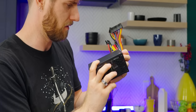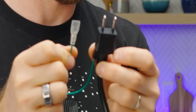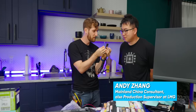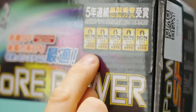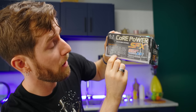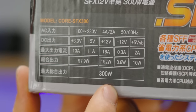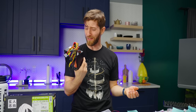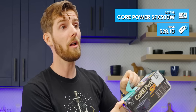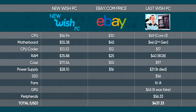These are not especially confidence-inspiring cables. Is this how grounding is supposed to work? Where in the world is that the standard? Our mainland China consultant says — what? Of the 300 watt total capacity, only 192 watts are on the 12 volt rail. This thing is freaking designed for like Pentium 4-era systems. Wait, but it was made in 2022? God, it doesn't even have active PFC. How much did I pay for it? $28. I still overpaid.